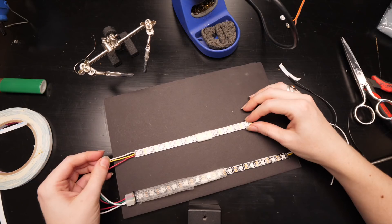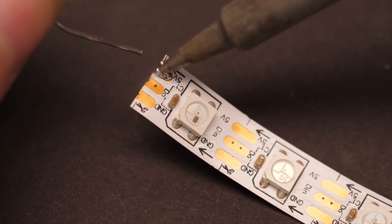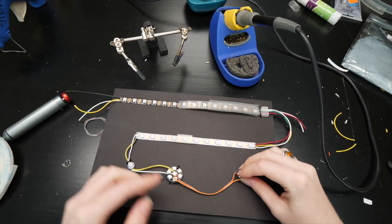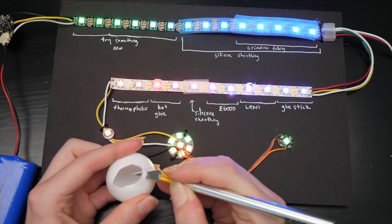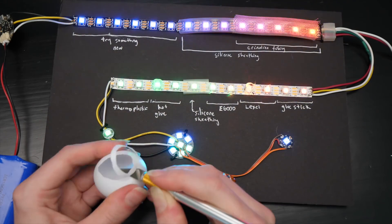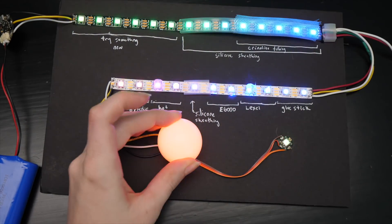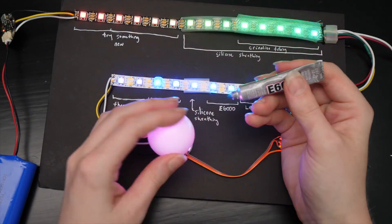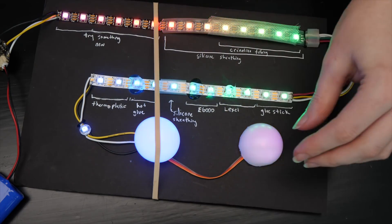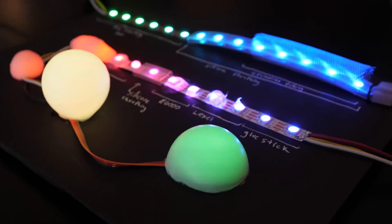To test out the next few techniques, I built a sample circuit with some NeoPixel strip and individual pixels on a scrap piece of foam core board. I'll be able to use this sampler in my classroom this fall, and it's also great for showing to costume clients. Ping pong balls are a classic diffusion idea that's not used nearly enough, in my opinion. Cut them in half, or cut a hole just big enough for your LED. Blast it with a cluster, like a NeoPixel jewel, or use a single LED.